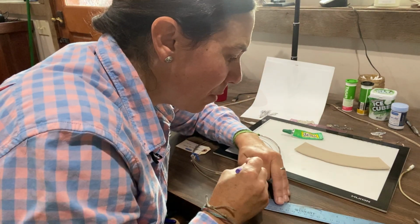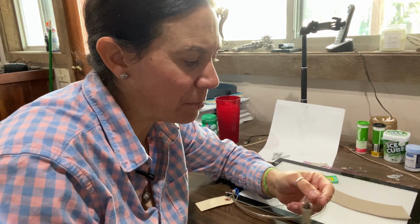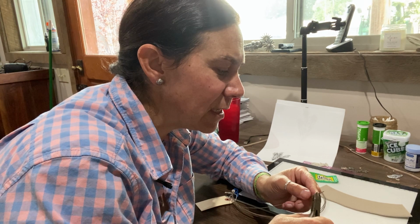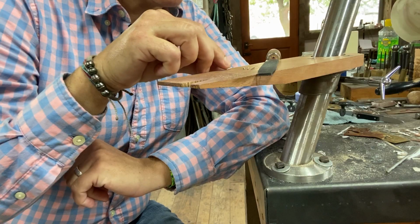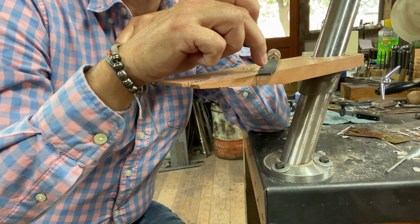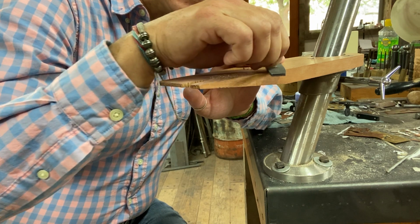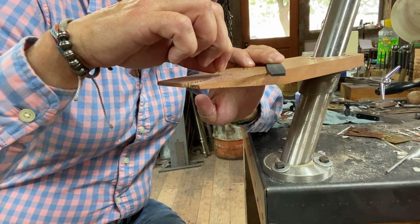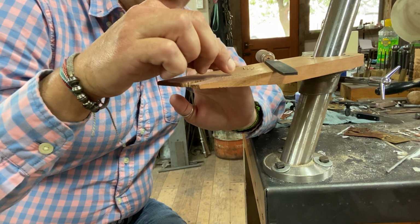There we go. Marked 1/2 inch. So then I'll take my side cutters. I always put the flat edge towards the side that I want to be flat. So I have my 4 little pieces, and this is a file, but I'm just gonna drag these across it like this, because I really want a very flat surface to solder to, so you don't have a big bubble around it.